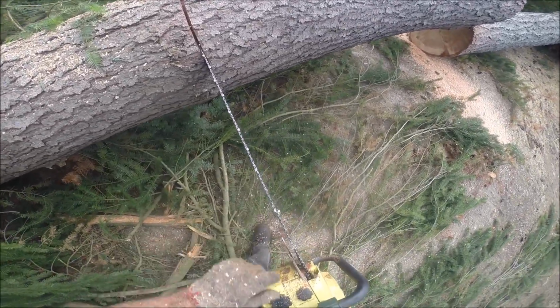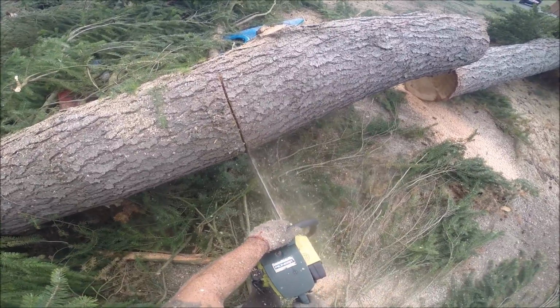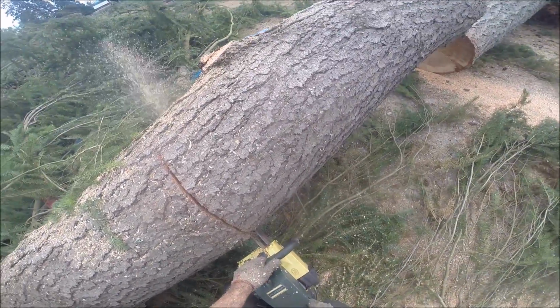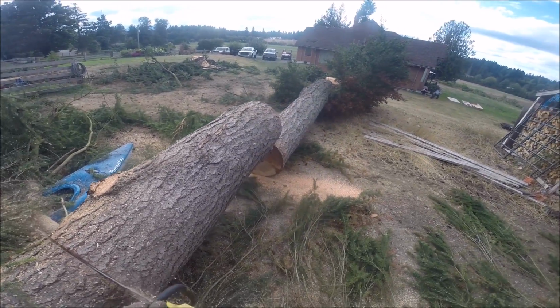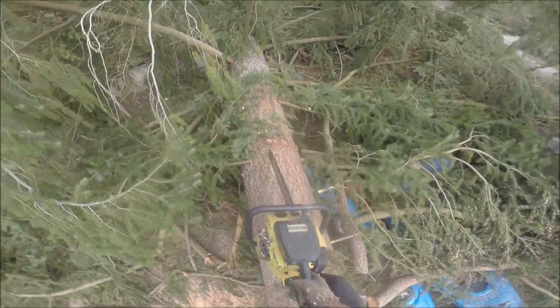Let's try and bore again, see if this isn't too hungry. I suggest practicing boring on a stock chain. When you buy a stock chain, practice your bore cuts. Too hungry, it doesn't bore that well. It'll chatter, jump around, it's dangerous. Don't have low rakers.